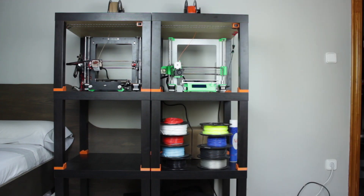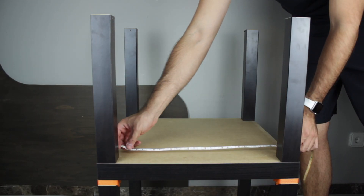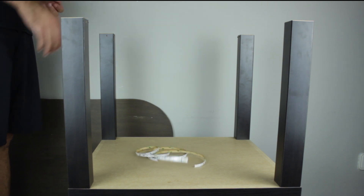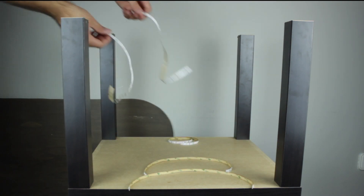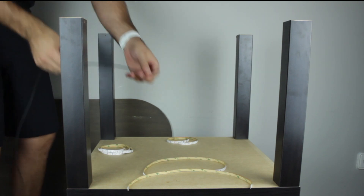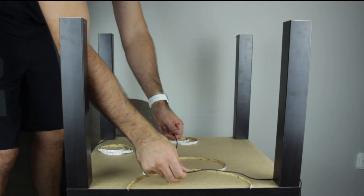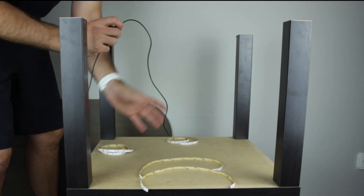To start, I'm going to empty the shelf to work better, and I'm going to measure the LED strips I'm going to install. We'll place three 45 cm portions on the ceiling of the table — two in the front and one in the back — and finally two 40 cm portions on the back of the front legs, so the photo studio will be super bright. Once decided, I'm going to check all the cables we need to run to attach each segment of the LED strip, running it through the power switch, and finally connecting it in the shelf on top.